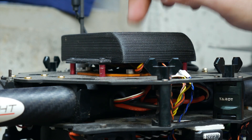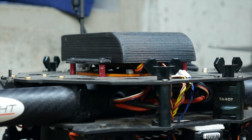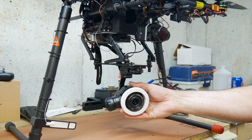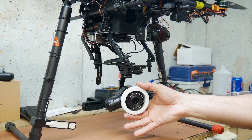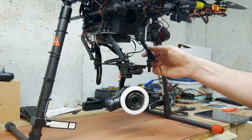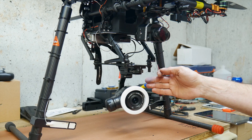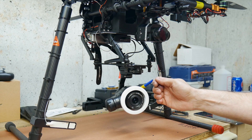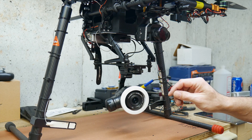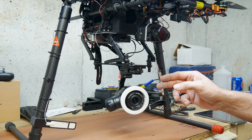The flight controller is under this cover here — it's the DJI N3 flight controller. I can't show you that right now, but if you'd like a more in-depth look I have a video on my channel so check that out. The cameras I have mounted on here: this is a DJI X5. In order to mount this camera I use the Matrice 600 camera mounting kit. I'm using a voltage step-down to power the camera and gimbal, set at 17 volts. But if you want to save a little weight, you can run the X3 instead.